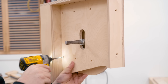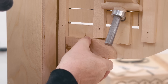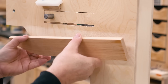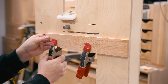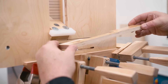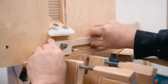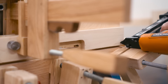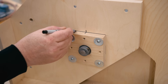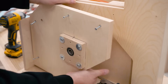I think I can improve that by adding some more structure on the upper part of the frame. The biggest reason for this happening is that there is a lot cut out on the upper part of the frame and it's just half inch plywood. So I'm going to start on the inside by adding a piece of half inch thick oak, and I'll do the same on the outside except this piece is a lot bigger and it extends right over to the edge of the bandsaw. Another problem is the wooden spring that's built into the frame is not stiff enough, so I'm going to bulk that up by adding a piece right here. In the meantime, I can shift my attention to the lower part of the bandsaw and mounting the motor, starting by making a permanent mark for the bearing block on the back. I also want to improve the grip that the stop collar has on the shaft by drilling a small hole for the set screw to fit into.